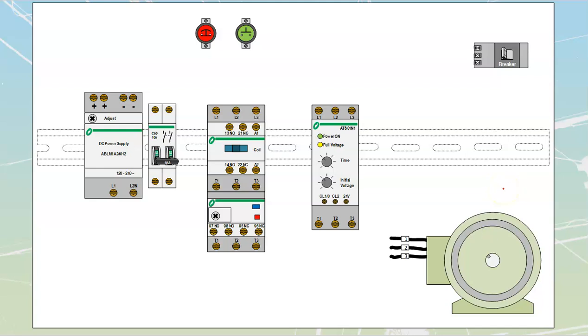What is new here is the soft starter component itself. This is what a soft start looks like — a very similar look to a contactor. Most of these are going to mount inside of cabinets. The smaller ones for smaller horsepower mount directly to din rail, while the larger ones are mounted with bolts to the back side of the enclosure. They are semiconductor, electronic devices and do need room around them to dissipate heat.